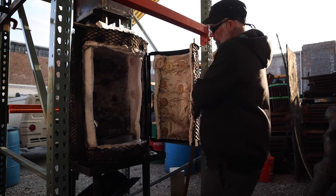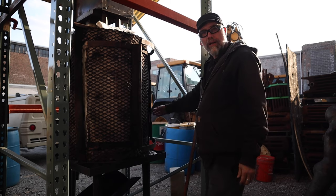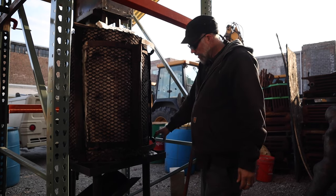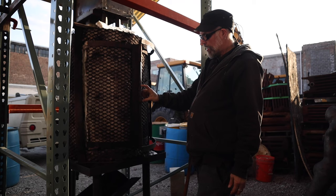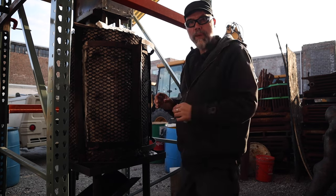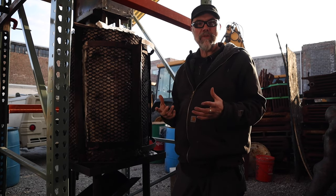So the way I've designed this door — the initial pivot points are out here on the outside edge, but then I have a bridge at the top and the bottom, and I actually have a second pivot point in the center of the door. This really winds up balancing the door a little bit better and gives us several characteristics that can really benefit you.